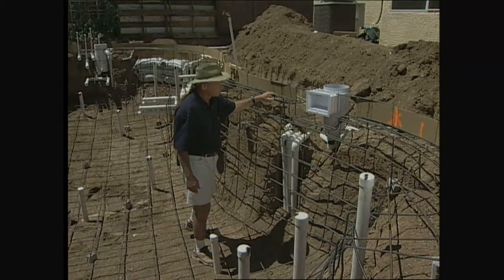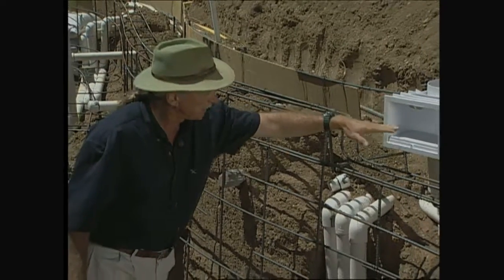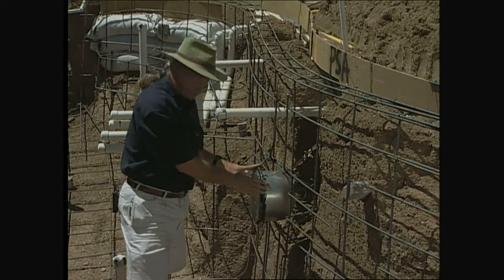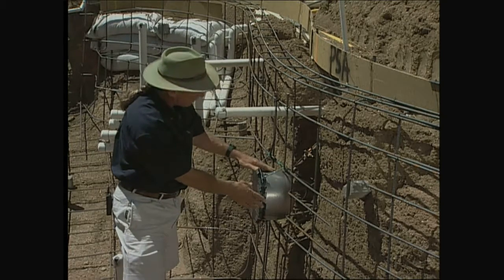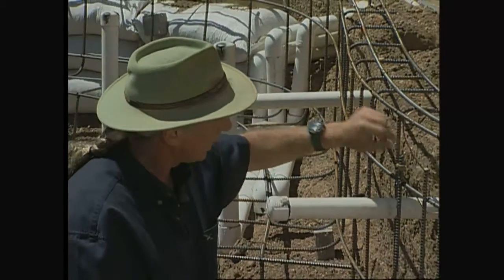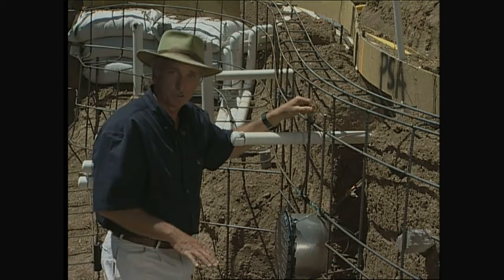One of the last things the plumber had to install was the skimmer — and this is it here. It's tied to the top of the bond beam of the pool so it remains in place. The water level of the pool actually ends up right in the middle of this skimmer — this is where the water flows in as part of the cleaning surface action. Back over here, this funny-looking little pot is actually the light niche that the electricians installed — the pool light will go in here, covered with tape so it doesn't get filled with gunite. Coming out of the back is a brass pipe that runs over to the wall where the light cord will tie in electrically. And this little copper wire, clamped to the pool steel in several places, is called the bond wire — it helps prevent electrical shocks from occurring in the pool.